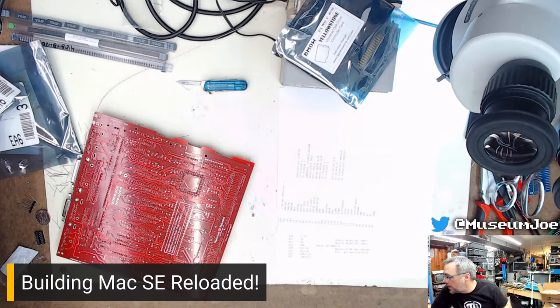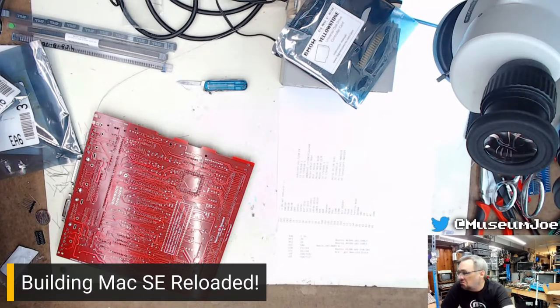Looking for a mod to make a 2E power supply work on 220 volts AC. Interesting you say that, Rudy. A lot of the Apple II power supplies actually just have an internal jumper, where if you just move the jumper, it'll go from 120 to 240 support. Internally, you're just changing the primary winding of the input, whatever it's called, thingamabobble. What is that, doodle? Transformer. Transformers, more than meets the eye.